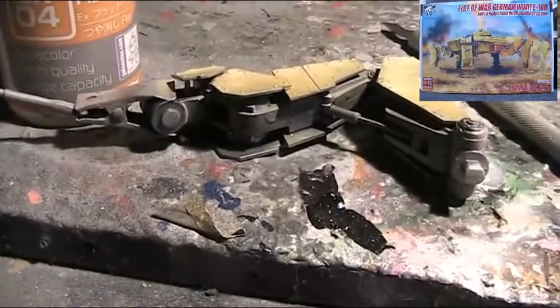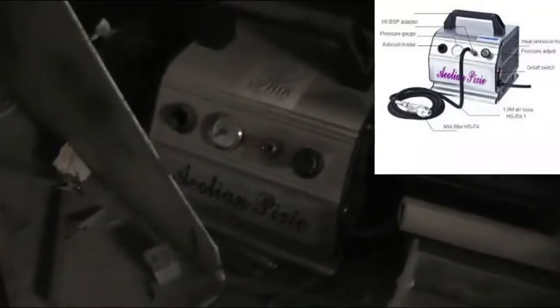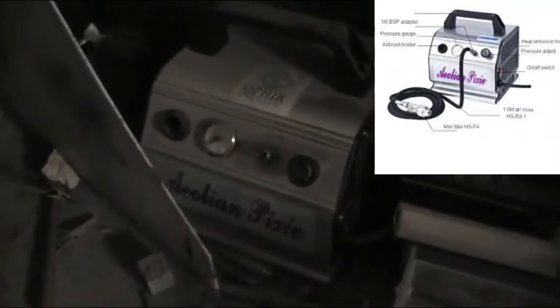That hairspray is completely useless. It's not going to chip anymore. Just a reminder of compressors. I'm going to turn it off. Actually, I forgot it's got a regulator. And we're going to disconnect it to allow it to dry. And any moisture caught in the hose or the system is going to release and not corrode the piston.